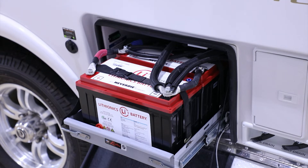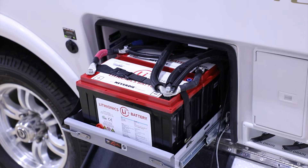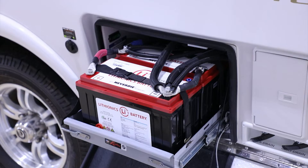As far as other operations of this battery, it is a lithium battery, so you don't really want to pay attention to the voltage as much as you want to check the state of charge. You're going to need the Lithionics battery app — log into each battery and take a look to see what the state of charge is, so you'll know how much power you still have or if you should be charging. With the lithium battery, you have the availability to use up to 100% of the charge state. It's different from an AGM or standard 12-volt where you roughly get about 50% before it drops below 12 volts. With the Lithionics lithium batteries, you can actually utilize up to 90% of the battery's charge at 12 volts or higher.